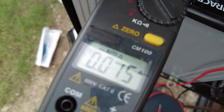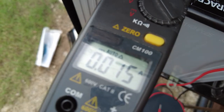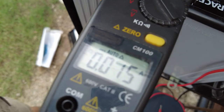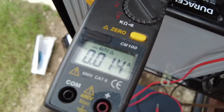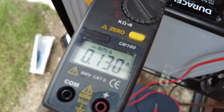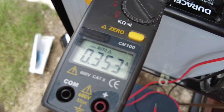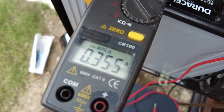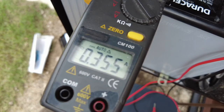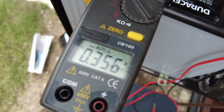The next thing I'm going to do is start plugging in one accessory at a time to see what this number gives me drawing off the battery system. So now I'm going to wake up the circuit board to where it powers up the safety beam and see what this climbs to. Almost 400 milliamps — 355. That's what I was expecting.